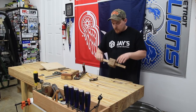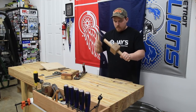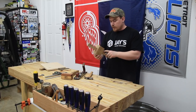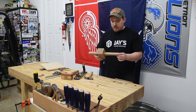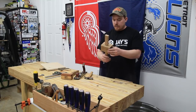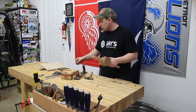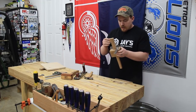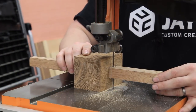That's a much better fit — just a couple passes with a hand plane. Now I can drive this all the way home as far as it'll go. That looks like it's about three quarters of an inch past my reference line, so I did make the mortise a little bit larger than I thought, but that's okay — I have plenty of extra room. The bottom of the handle is about as long as I want it to be. I have a bunch of leftover at the top, so I'll use an engineer square — about an eighth of an inch thick — to mark and then trim that off at the bandsaw.